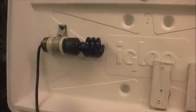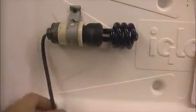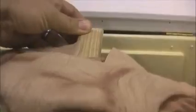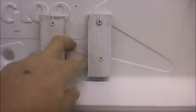Hot glue is great for some things. Anyway, I'll do that later. And now we'll see the inside. There's the black light bolted to the top, running off AC. Had a relay in there running that. I had to put these guides in here. This was the top of Dobby's head. And then that guide indexed in here, because otherwise the air cylinder, when you pull up on it, wants to rotate out of position.